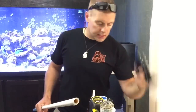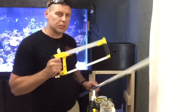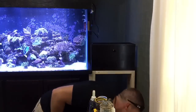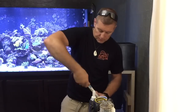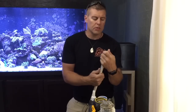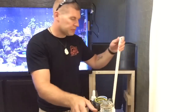So we're going to measure our 32 inches and cut. I'm going to use a hacksaw — you can use whatever you want. So we got our piece at 32 inches. I like to clean the burrs out, so I just take my knife and clean her up. You can also take a little sandpaper on the edges. I got a pipe that doesn't need primer — all the primer does is take the coating off. I don't like using the primer because it doesn't do as nice a job in my opinion.